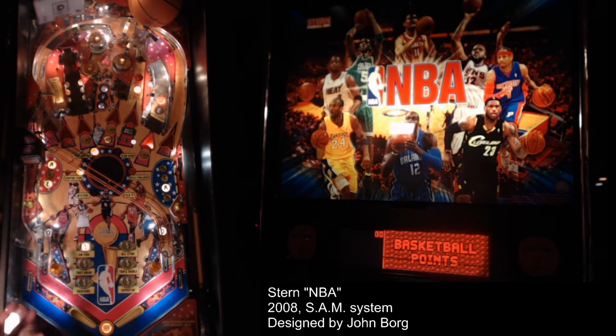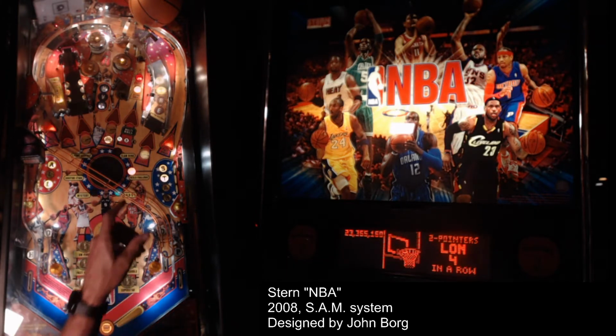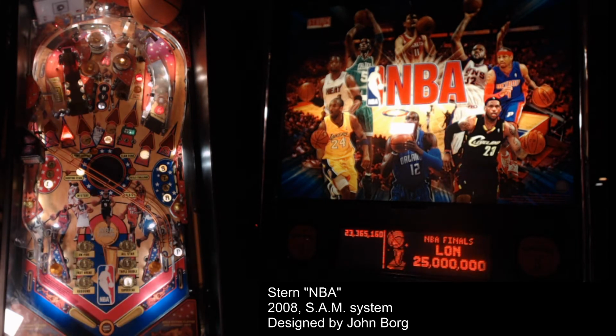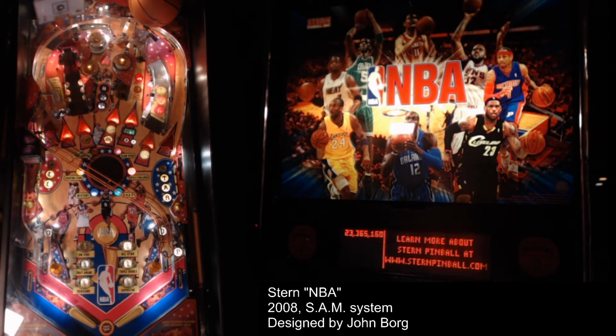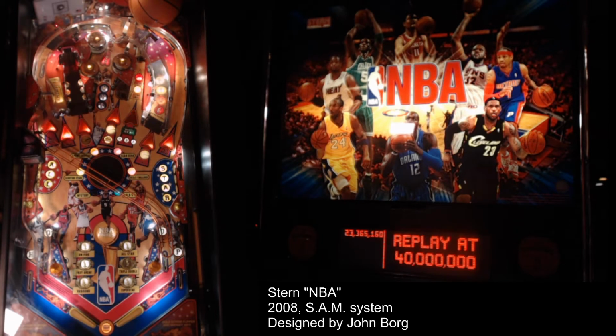Mostly, it was flipper plunger links, it was springs that broke, it was yokes on pop bumpers. So it was things that just worked so well for so long, they finally just gave up. So I'm kind of impressed with this design from that perspective. This is a game you could probably throw on location and it'll just run and run and run as long as you just provide the minimum maintenance.